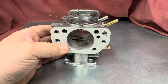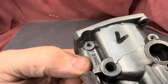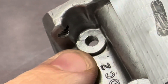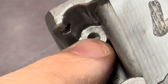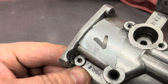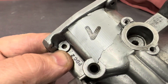So here I have a HI-44 carb body. Well, in this case we've got a problem and it's leaking. We've not got any cracking, but what we have got is where the float screw screws into the casting, you'll see there's a line in the casting which looks like a crack but it's not. That's actually a fault in the casting which means at that point it's not flat. This particular casting hasn't been machined from the factory to have a spot face on it. So what we need to do, in order to make that seal, is put that spot facing on to clean that surface up.